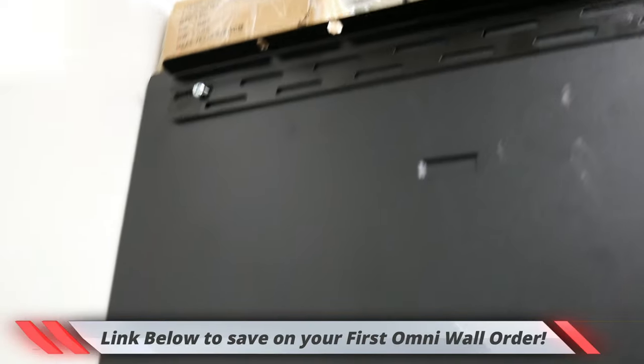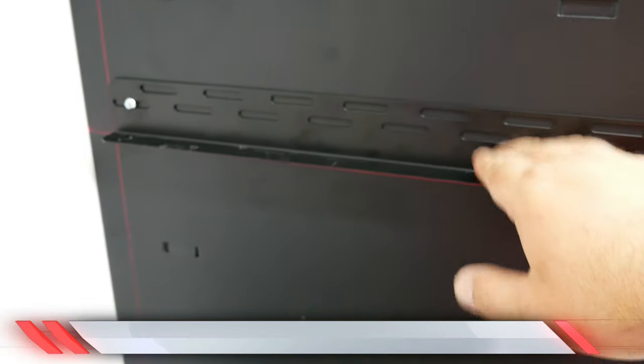So I ran into not a dilemma but an option I need to make. This is exactly how you would mount one panel with those two brackets. Now if you want to stack panels, you would mount this top bracket and then another top bracket instead of the bottom bracket, then a bottom bracket down there, and this panel and this panel will interlink right here. That's actually what I'm going to do — just to show you guys how to do that version since I've already shown this version.